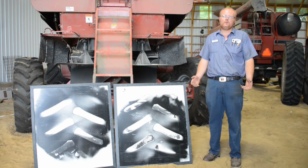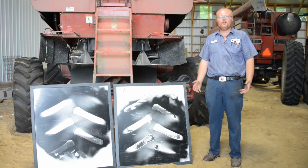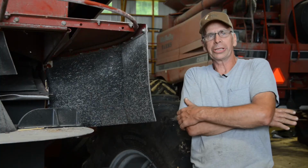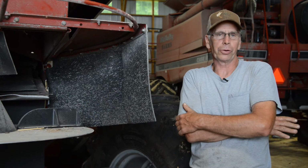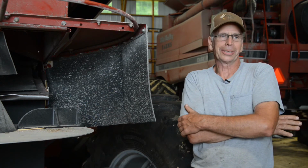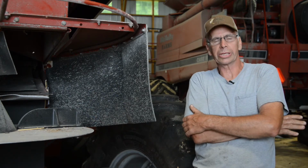I believe we aired them up to 30 just to get the beads to seat and everything, so 7 pounds of air made a 3,000 pounds difference. It's almost hard to believe, but he had the scales there, and as you let air out, it actually made a lighter footprint. I guess it's just spreading that pattern out more evenly.